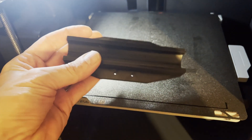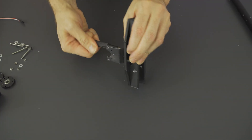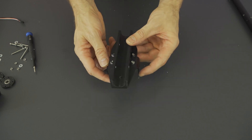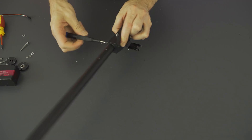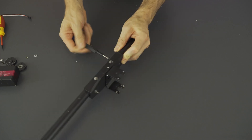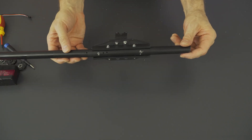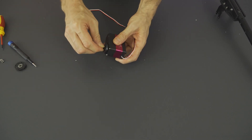The finished adapter looks great. Now I can put the mechanism back together. I attach the adapter plate to the bracket using M3 screws, and of course some nuts are added to secure everything - I'm not simply screwing into the PLA. Then the pipe is attached to the adapter with four screws: two horizontally and two vertically. Perhaps a little overkill, but it now seems very stable. Then I attach the bracket including the pipe to the servo - first I screw the driving wheel to the motor, then I put the support wheel on the opposite side, and finally add the bracket using screws.